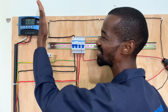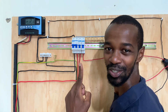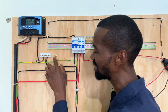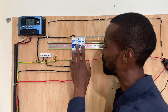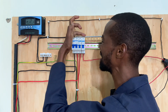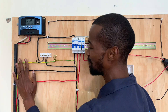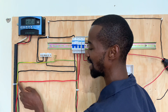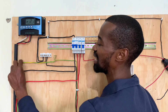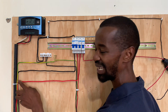My solar section is completely charging — we'll talk about solar in the next video. For now, let us dive into the consumer unit. The consumer unit is as simple as I'm going to explain it. We have the hot bar here, and all of these are in the consumer unit. At the point where we have the live connection, the mains come in with the live connection and get served to the MCBs. The mains come in with the cables: we have the phase coming in — I'm taking this one as the red phase — and then the neutral or return wire, and the earth going direct to the earth bar.